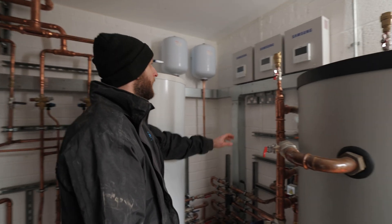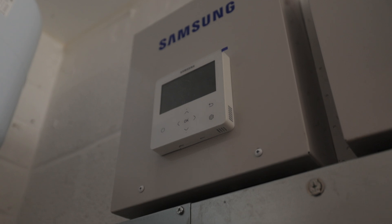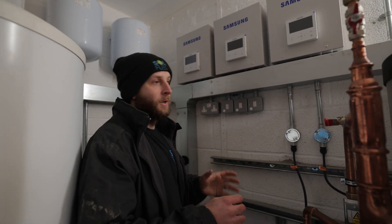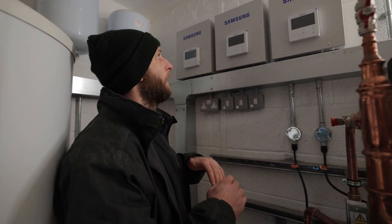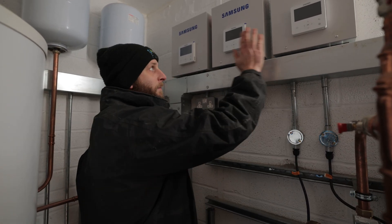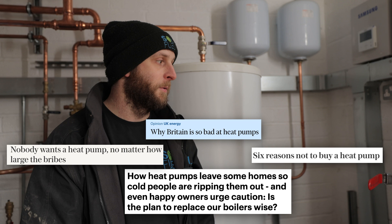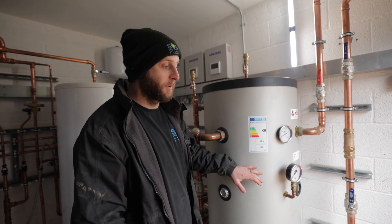So this is the plant room. Up here we've got our three controllers for the three heat pumps. These heat pumps were specified, so we've had to go with Samsung. The disadvantage of Samsung is you can't parallel the comms together, so all three are going to work independently. Some heat pumps share the load — one runs for a couple of hours then swaps to another — but these are just on or off. We've got underfloor heating over in the house, so that's going to send a heat pump run signal over here, which will flick a switch in each controller and tell them to run. There's a lot of bad press about heat pumps, but if you can heat a house like this with three heat pumps, they're certainly working.